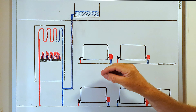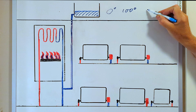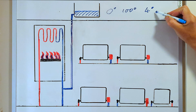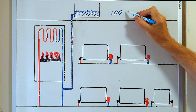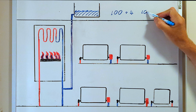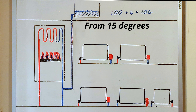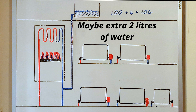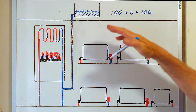Here's a little bit of physics: when you heat water from zero degrees up to 100 degrees — boiling point — it expands by roughly four percent. If you had 100 bottles of water and heated them from zero to 100 degrees, you'd then have 104 bottles. In a central heating system we're more likely heating from 15 degrees to 65 degrees. With 100 litres of water in the system, when heated you'd have roughly 102 litres — an extra two litres that needs to go somewhere, because water cannot be compressed like air.